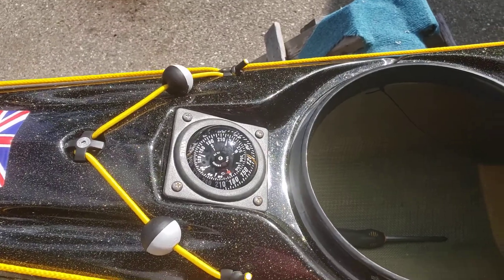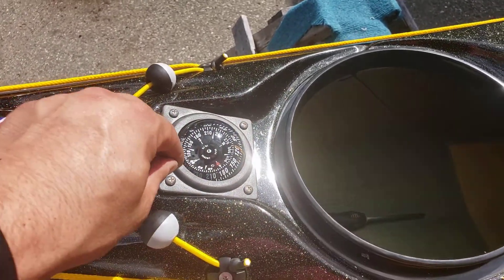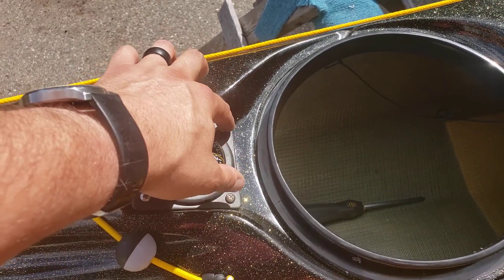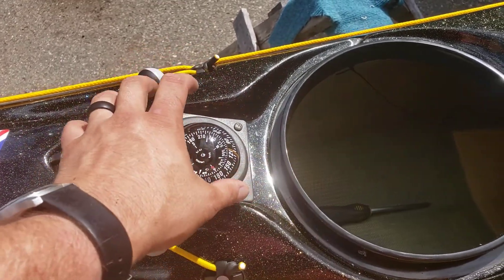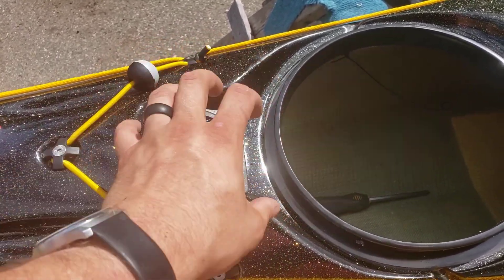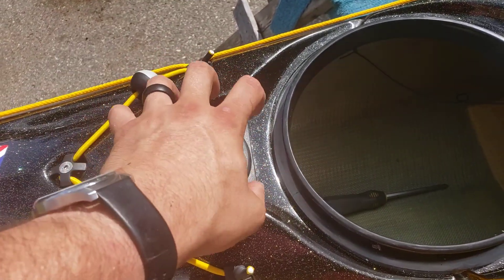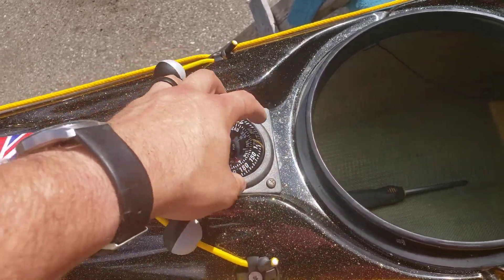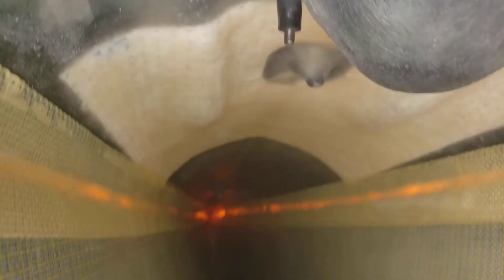We have the stainless steel machine screws in through the holes we drilled in the hull. We drilled the first one, put a screw in it to hold it, then drilled the second one opposite — kind of like a star pattern. I didn't want to put any pressure on the hull by misaligning things, so I started here, went to here, put a screw in, maneuvered things around so they were nice and loose, then put another one here and then here, trying to take as much pressure off the inside as possible.